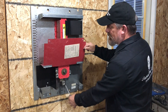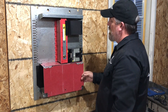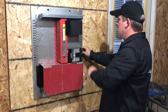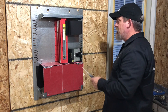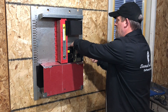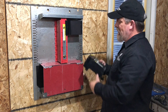Here is where your power would come in — this would be your A, B, and C phase connections for your three-phase power coming into the panel. With the breaker off, we're going to loosen one little retainer screw, back it out, then take your screwdriver and just walk it out — slide it right out. It leverages right out of there. This is our bad breaker.